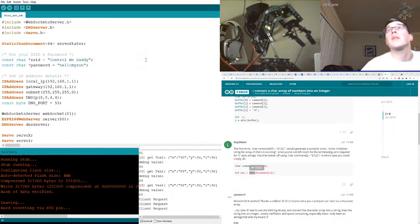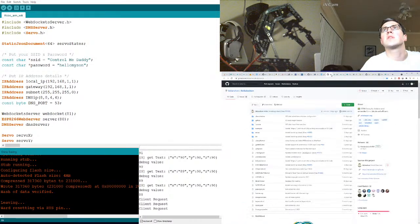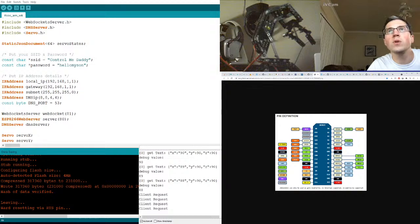14. There was a picture that actually shows that, for whatever reason, it doesn't map 1 for 1. Oh, here we go. Yeah, it doesn't map 1 for 1 with the stuff listed on the board. Like the label printed shows D8. Right now I'm in D8, but it's GPIO 15. Consequently, if we just walk it down, it goes 14 or 13. Where's 14? We just don't have 14. We just decided to skip that.